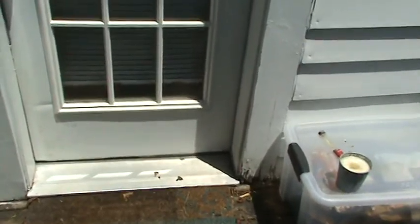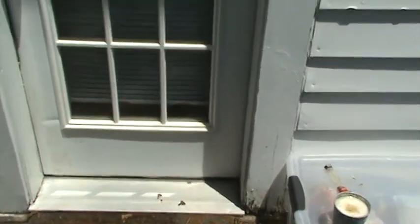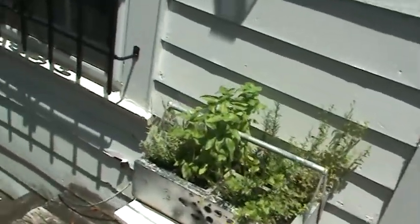The right side of this unit's door frame is rotted as well. No one's repaired it yet, and you can see the difference. This is a one by six on the inside and a one by eight on the outside. What's happening is they didn't back prime the replacement wood — this stuff's all been replaced before. You can see all the air nail holes — they didn't even caulk this stuff, they just slammed it in and said have a nice day. When we repair it, we back prime everything, caulk it up good, and then it's good for a long time — not just a little year repair.